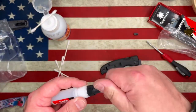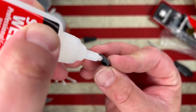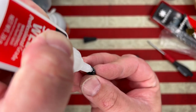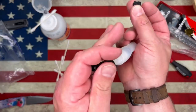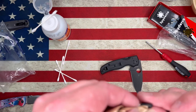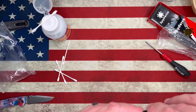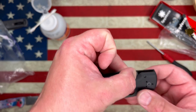I let the alcohol dry, and then I slowed the video down to real time so you guys can see me place the glue. It doesn't take much — I actually used a little too much here. I recommend having a toothpick or a piece of cardboard handy while you're doing this. I took a little piece of cardboard, folded it over, and used the edge to distribute the glue and take a little bit off, because you don't want the glue to run out around the sides. You want a nice thin layer of glue across the entire mating surface of the CME.